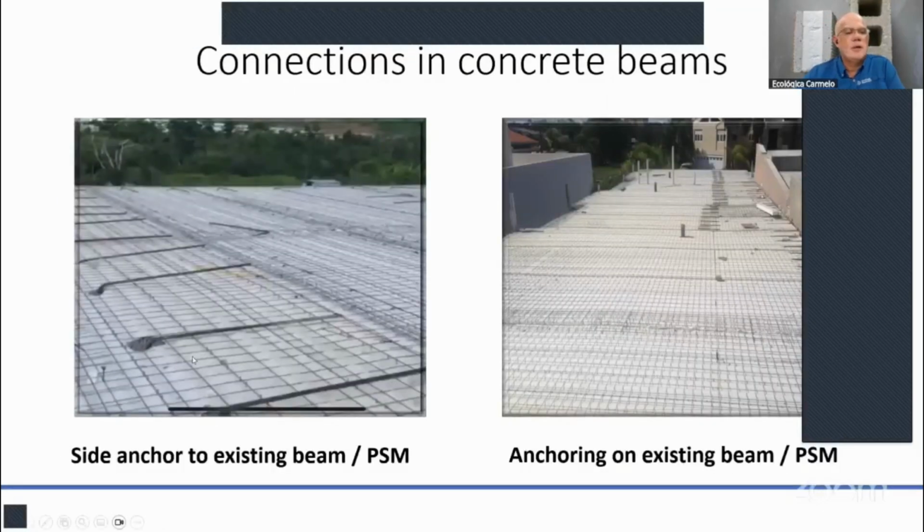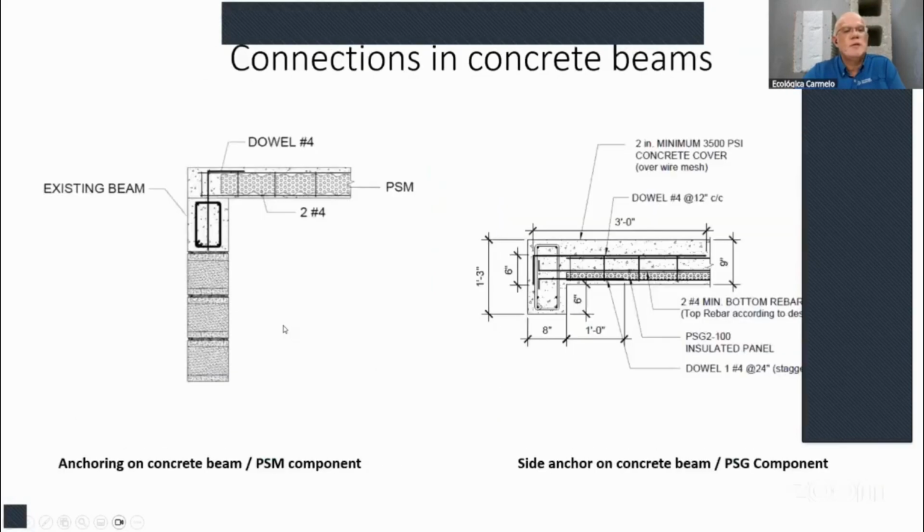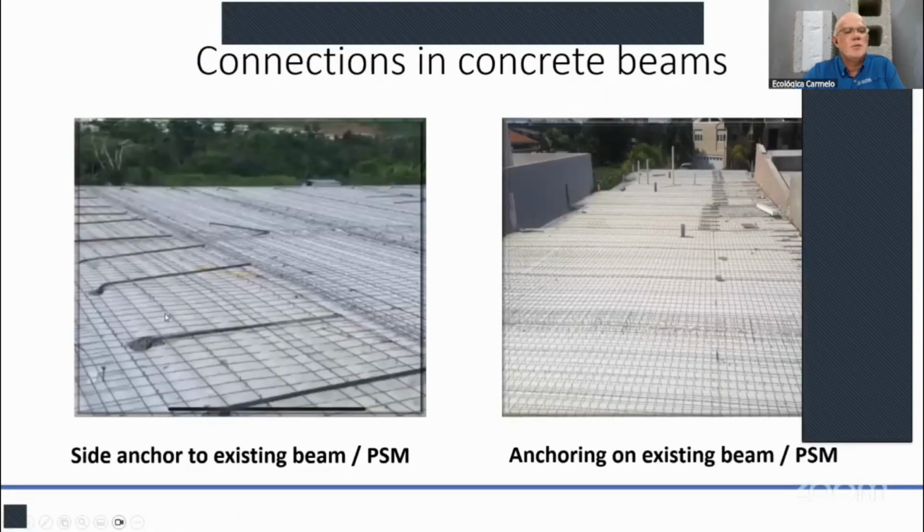And this is how those L rebars are anchoring to, let's say, the roof. If I go back here, see how they anchored here to that beam. This is where the beam was at. And so they bent the rebar over the panels. See, they did additional reinforcement of the mesh. You can say this is like a splice mesh here when you're adding more flat mesh over that.